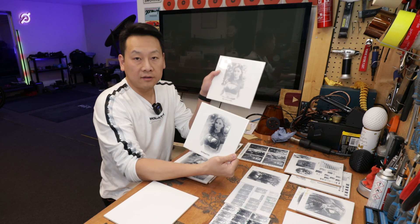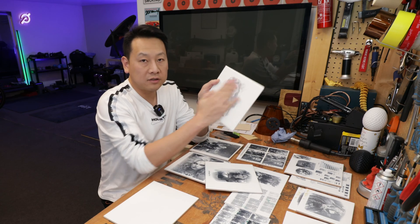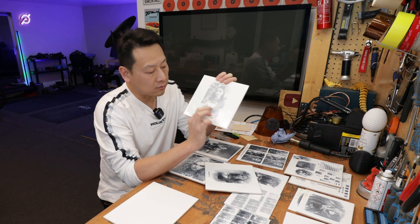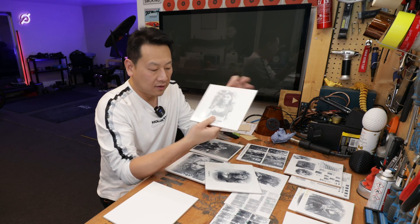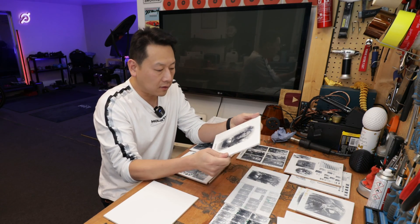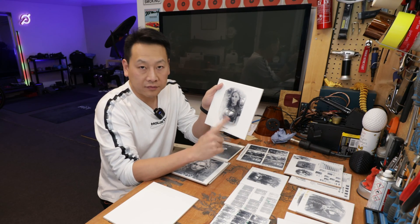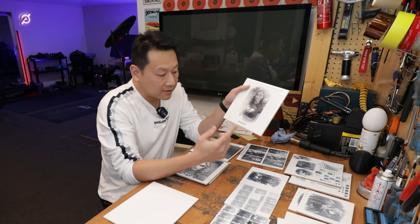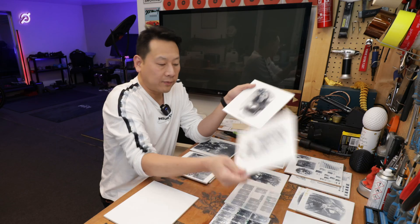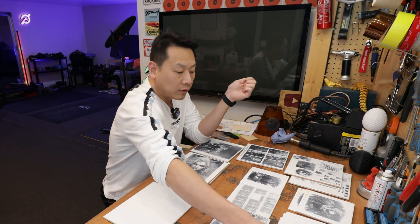This is the typical result you get from the different lasers. The 1064 nanometer laser gives a really smooth surface, but not as dark color engraving — almost like a silver tint. Whereas the 450 nanometer, which is the typical diode laser, gives you a bit more black and a rough surface finish. I'm hoping to get that kind of color with these kinds of details, but at the moment I've failed to do that with this laser.